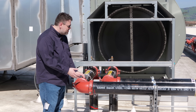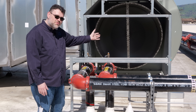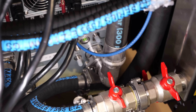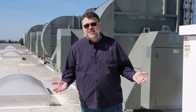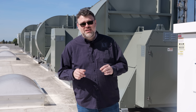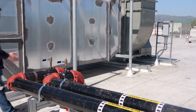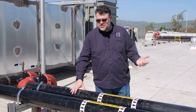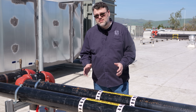This is the other end of those cooling pipes we saw downstairs — it goes down and connects to the aisle, and several of them connect as it goes through the rest of the roof. This is managing the cool water supply from the outside from the Supermicro cooling tower, which is actually a product you can buy now — it's in their catalog. A building roof typically has a lot of cooling infrastructure already, but the nice thing about this type of rack cooling is you don't need large air handlers. To cool entire aisles of liquid cooling, you just need a couple of 8-inch iron pipes. If you need to expand, you just add a couple more pipes to carry the cooled liquid down to the racks.